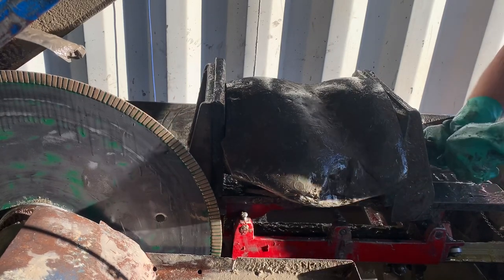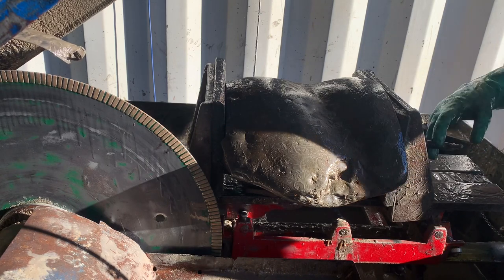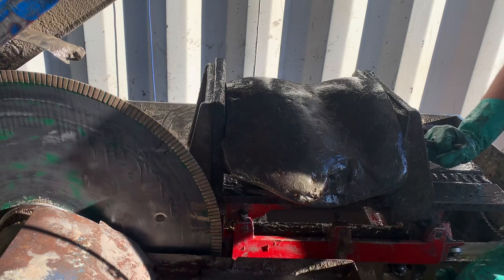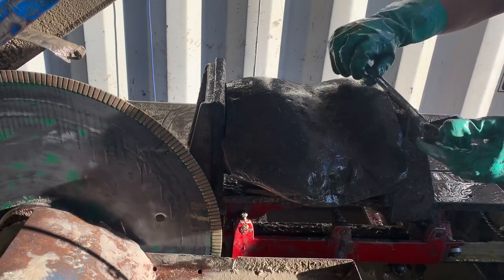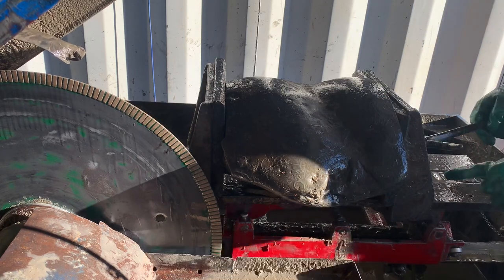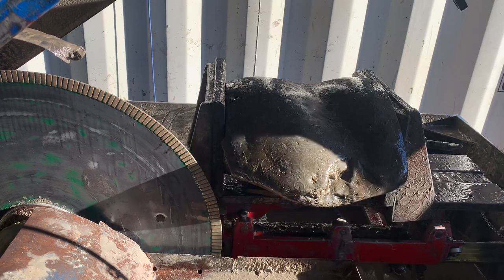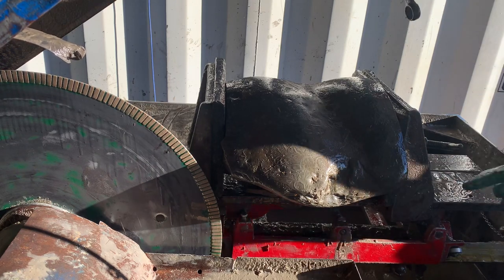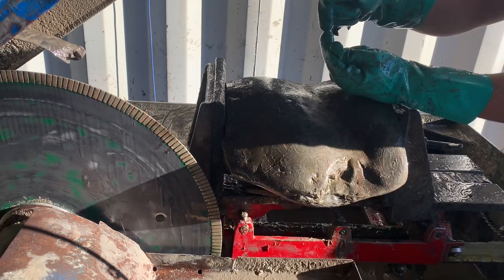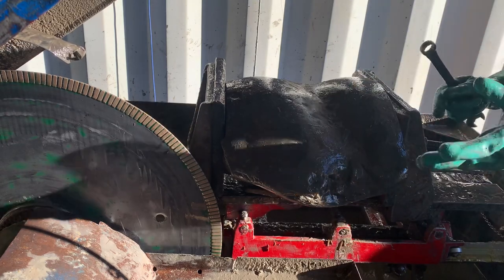Now, you can do two different things for the tightening. Option one is use your hands and go till it hurts. But if you're not very strong with your arms and your hands and your back, another option is use something like this. Now, you want to be careful that on the teeth in this tray, the back of the vise pin, the foot of it, needs to be centered on that tooth. So if you have a slight angle, then you don't have consistent pressure through the clamp. So that's something to consider.